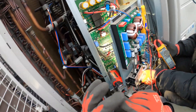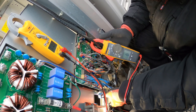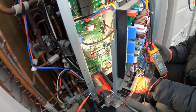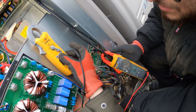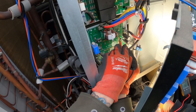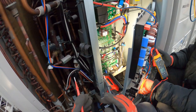We're going to do a diode test right now. We're supposed to read 0.38 to 0.7 volts. What we got: 3.7... now it's 12.5, 12 — look at 12.9. It's supposed to be 0.38 to 0.7. Right away, that's bad too. This board is fried. Let's check this side — got nothing. All right, let's try this again — still nothing.